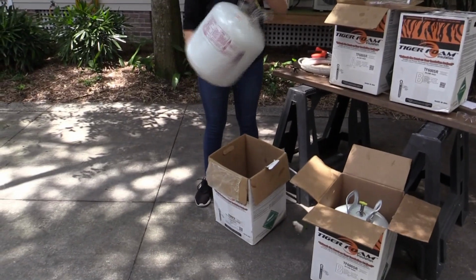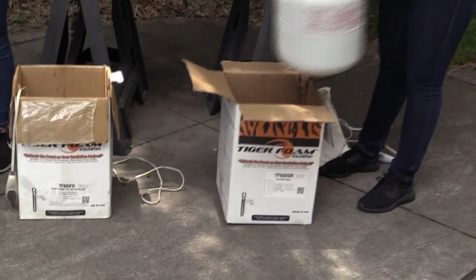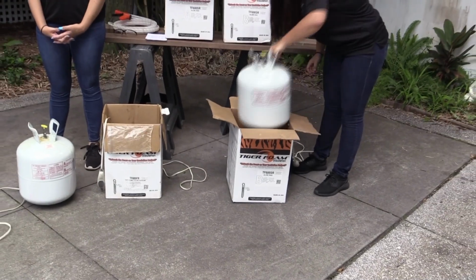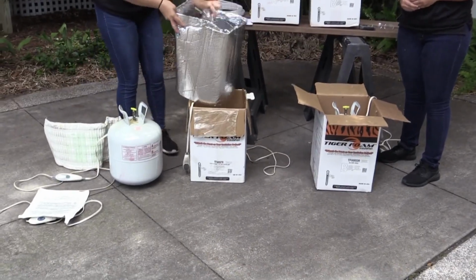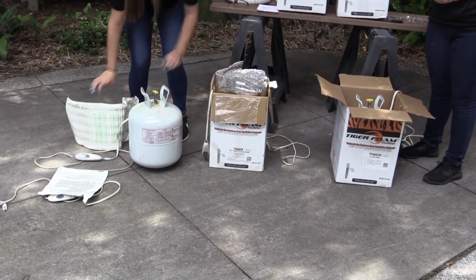If the tank temperature is below 75 degrees, you will need to heat the tank. If the temperature is between 70 and 75 degrees, remove the tank from the carton, put one heating pad in the bottom, and return the tank to the carton to heat. If the tank measures below 70 degrees or the air temperature is below 70 degrees, you should use a tank blanket and 3 heating pads.